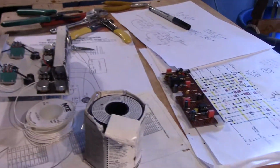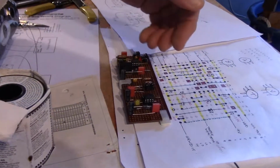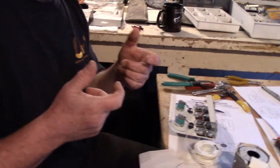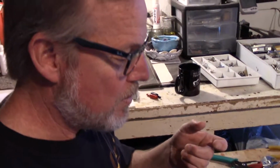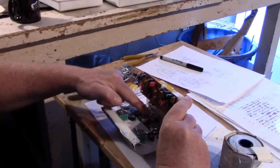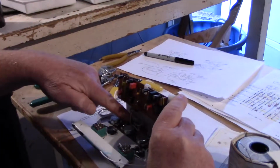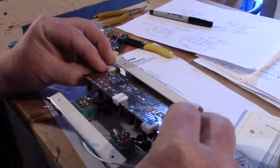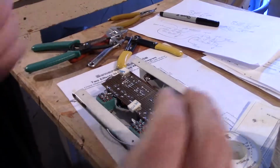That'll keep down the amount of wire that is being folded over on the board back and forth, which is another concern too. Once you solder something in place, it becomes rigid. If you're doing a lot of bending back and forth, you risk having it snap off. And then get down in here with my soldering iron and make the connection, and then only fold it down the final time when it goes to where it rests.